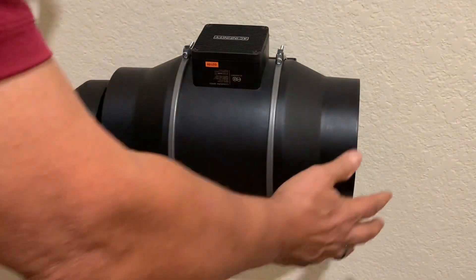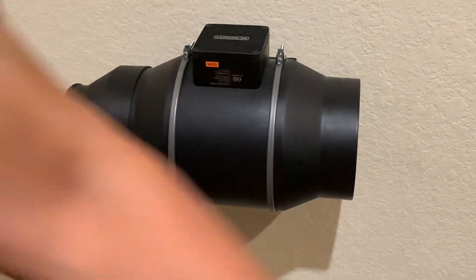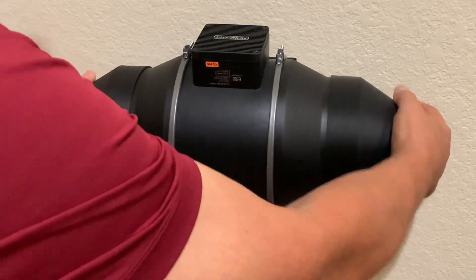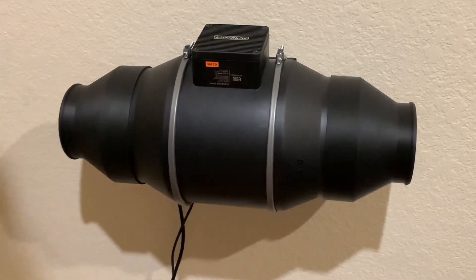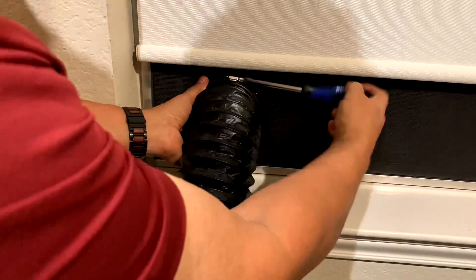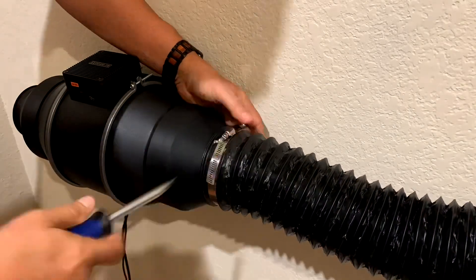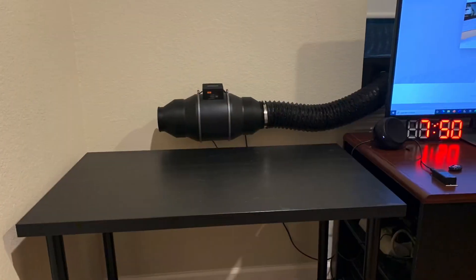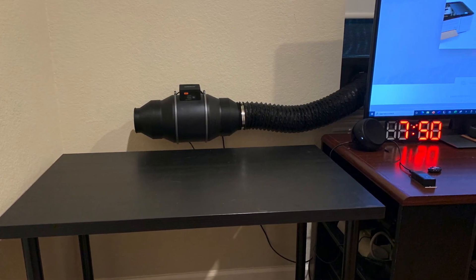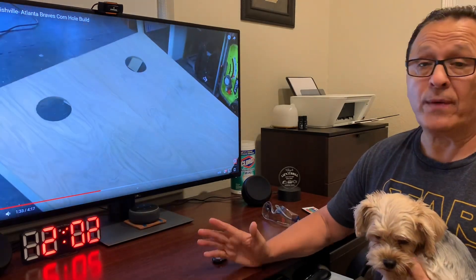After measuring, I am now mounting the exhaust fan onto the wall — and not on the table — because I don't want anything vibrating on the same surface that my Glowforge is on. I then get my 3D printed reducer adapters and push them snugly into place. Next I get my four inch hosing and screw it to the exhaust port on the window and then onto the exhaust port on my external fan.